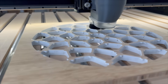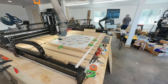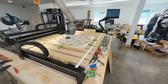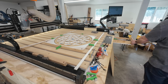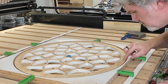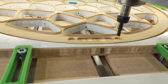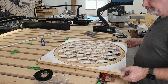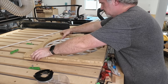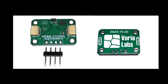After the paint dries, the next step is to drill out all of the screw holes in the back of the sheet, which will be used to hold the back plates later. Then it's time to machine out the front. This involves a few steps: cutting out the groove that the diffusers and cover lenses will fit into, as well as performing the v-carve texture in between the cells. This v-carve makes the cells appear like stones embedded in a bamboo grout. It was at this point that I noticed these tiny dimples in the centers of the touch control buttons — a quick pass with an end mill clears that right up. You can see the big notch on the bottom to make room for installing the touch sensor board, as well as the two smaller notches for the ambient light sensor boards. I do sell these ambient light sensors on my website, so if you'd like to support what I'm doing here, check out the links in the description.